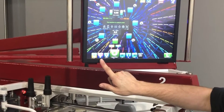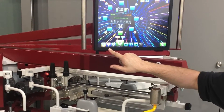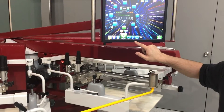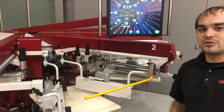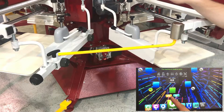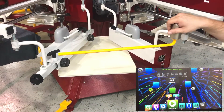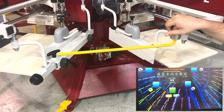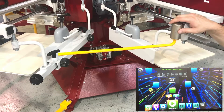Located here, we've got a button that says full. By pushing this, we can switch it to half, which allows us to do half indexing. This will allow us to bring the pallets to a halfway point, making it easier to clean a screen or check an image. Instead of using this button to go half, I prefer to use the clear screen button. What this does is bring it to a half index, and when I'm finished, I push the same button and it brings me back to where I left off — so I don't have to remember which direction I went and I don't have to hit multiple buttons.